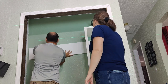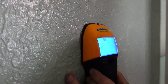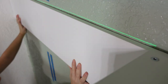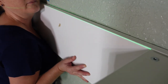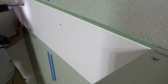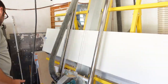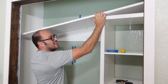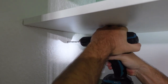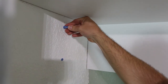The board needed to be cut to length, so we put it into position and marked where to cut it. After it was cut to the proper length, we marked our studs, pre-drilled, then screwed the board to the wall, making sure to have them securely screwed into the studs to allow more weight to be hung on the shelves. Next came the top shelf. We used the same melamine shelf material for the same reason — we only had to cut it to length to make it fit, so not having to paint really saved us a lot of time. For the support on the side wall, there weren't any studs to screw into, so I just used a couple of heavy duty drywall anchors.